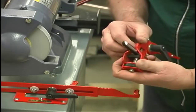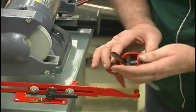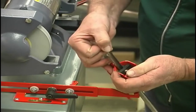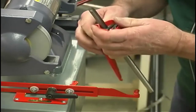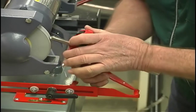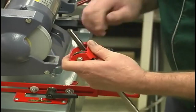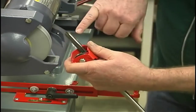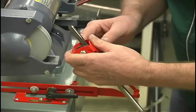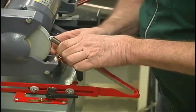With everything locked down, don't just look at what they grind. I've got a little spot right in here that's still shiny — that hasn't been sharpened. Now that doesn't mean I have to sharpen the whole tool if it's not needed. I'll just sharpen that spot, as long as I keep my cutting edge in a nice radius with no hooks, no flat spots — just what I need to make a nice, smooth, clean cut.